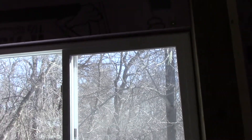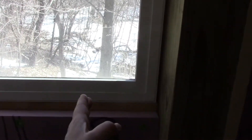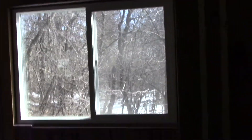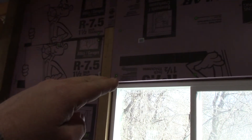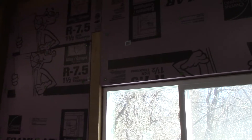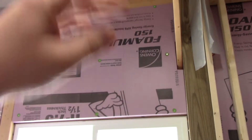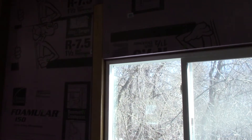I'm putting my rafters 24 inches on center, so I'm going to have at least two ceiling joists that are going to land in here. The first one I already figured out is going to be about here, and the other one will be 24 inches down, right in here. So I'm going to frame this in a peculiar way — I'll frame the bottom part normal, but stop my studs right at this level, then run a header all the way across this opening. On top of the header I'll stud it back up to get to where I need to be, and that should give me the support I need.